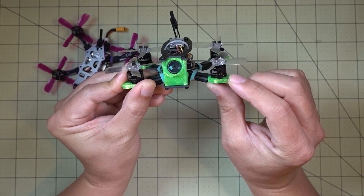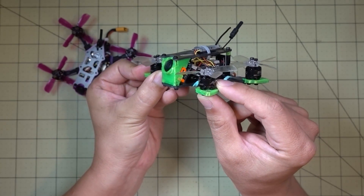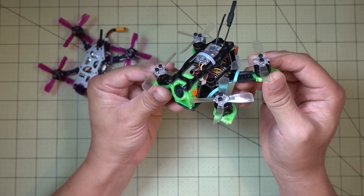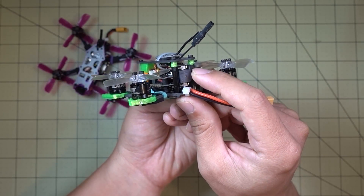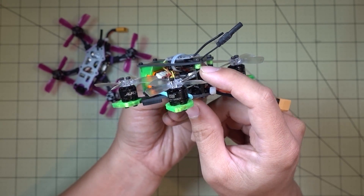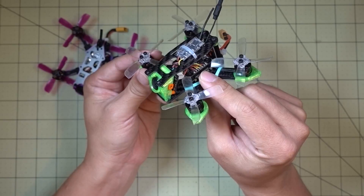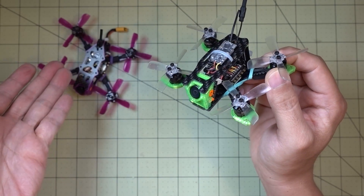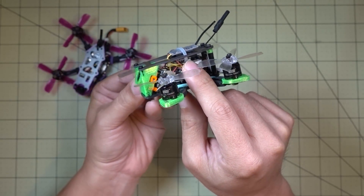I got some motor bumpers here and I'm just using them as soft mounts as well. I decided to put them on the top and use them as soft mounts because the motors on here are soft mounted too — I kind of need that for the vibration produced on 3S. The little mount here is a little bit too tall, so I had to put some spacers in the back because the included standoffs weren't tall enough. I'll put links to all these Thingiverse parts in the description. If you have an ARFun 90 or ARFun 95, you can swap those parts into this frame, add your own RunCam Micro, and basically have something similar to the SPC Maker 95GF. The video transmitter I'm using is the VTX-03 — it's a 25 and 200 milliwatt power-switchable video transmitter, with the antenna coming out of the top.